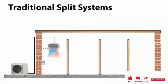The reason VRF units were designed is because traditional split AC unit systems can only provide cooling to a single zone and that zone can only be heated or cooled. As you can see on the screen, we've got a building with our outdoor condenser unit and our evaporator inside the cassette, and this unit can only provide heating or cooling.